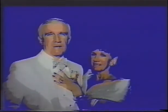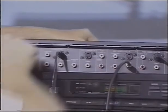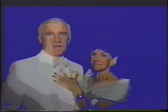I was a little uneasy about showing you this effect in the first Digital Mixer videotape, for fear it could possibly damage your machine. But Peter Utz, the great video author, assured me it was okay. If your source input is in channel 2 on your Digital Mixer, and you take one of the spare record outputs and loop it through into channel 1 input, you can get some pretty weird and unique effects using the mix slider dissolving between both channels.